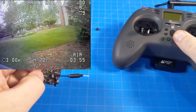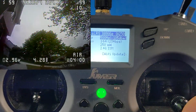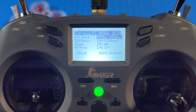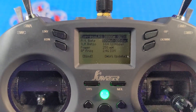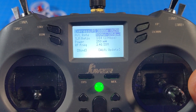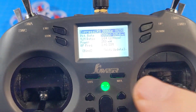Let me turn this on and I want to show you the menu here. I've got this about as close in as I can bring it for you to see it. You see I'm running a packet rate of 500 Hz, which is the highest supported at the current time. ExpressLRS is developing so things could always change. I've also got the milliwatts at 250, which can go higher than that as well. And you see I'm running the RF frequency at 2.4 gigahertz.